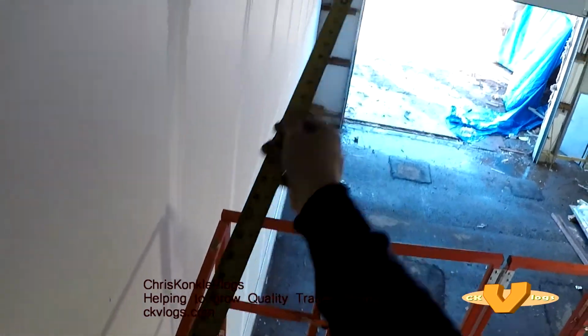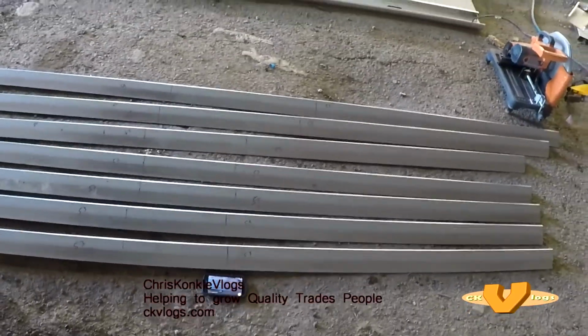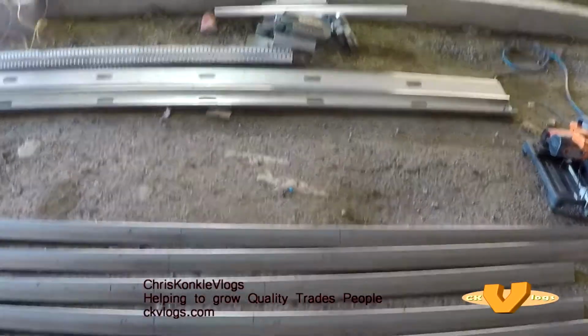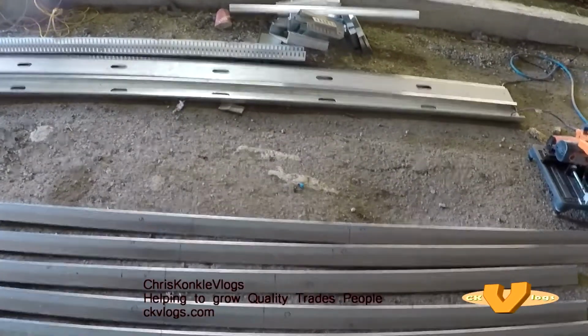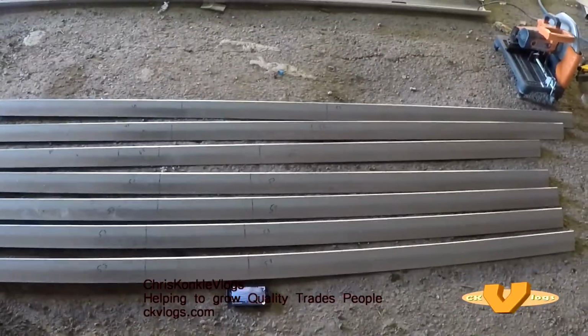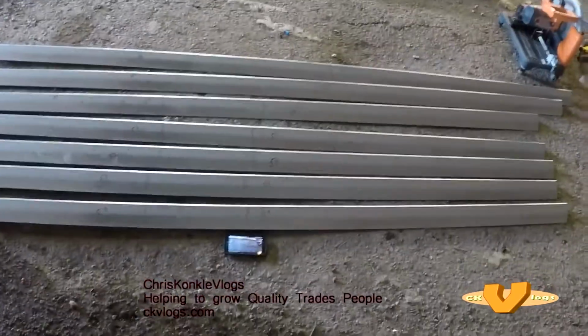A good tape measure will extend out 8 feet before breaking. Make all your measurements and do all the same steps at once. So you're marking, you're squaring, and then you're cutting. You see, you're not marking, squaring, and cutting each piece one at a time. You're marking, squaring, cutting, doing all your steps at once so that you're not wasting time. It'll take you forever if you do it the other way.